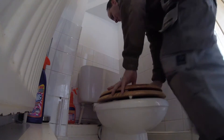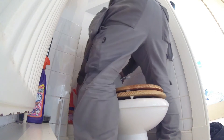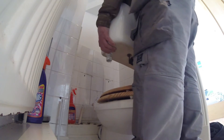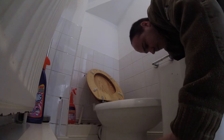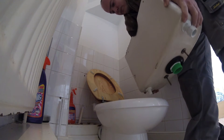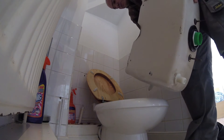These are some of the problems you can hit when you're doing this sort of work. At this point I'll lift the cistern off, but it's extremely heavy so just be careful. The best way is probably to get a wee cup and scoop the water out as much as you can, or a sponge - a sponge is ideal for that. Make sure you've got some dust sheets or towels down there to catch any water because you will spill some. Just be very careful - if it slips you can actually crack your toilet and smash your cistern.